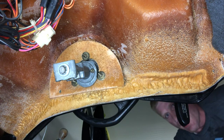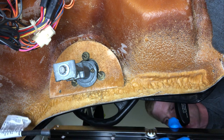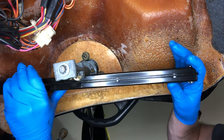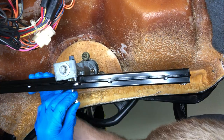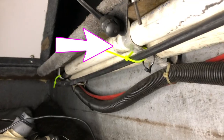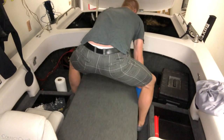Done. I always have to hook up the last piece. I put some more marine grease right here on the splines — I don't think it necessarily said to, but I'm going to anyway. This came with new hardware, so I'll just use the hardware that came with it. Zip tie the cable in all the locations where zip ties were removed. Now from here, we just have to put the boat all back together.